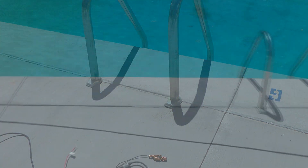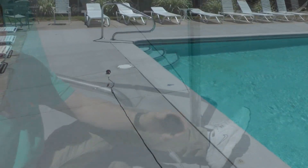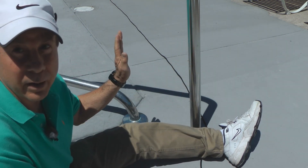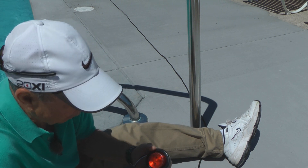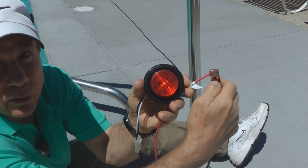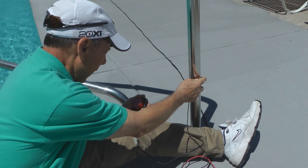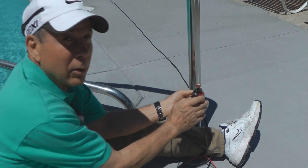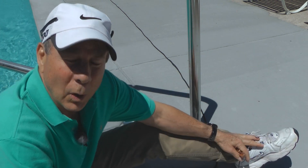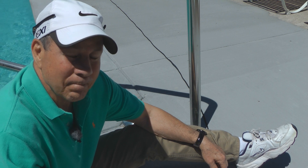Let's test the last one — stretching down to the far end of the pool. We're at the last northeast corner of the pool, and this is the last handrail we have to check. It looks like the continuity and all the wiring is good. We've got the light coming on, and the light does come on. We've got good continuity to all the handrails and ladders around the pool, which is good. That's the first time I've checked it, and that's a good sign.